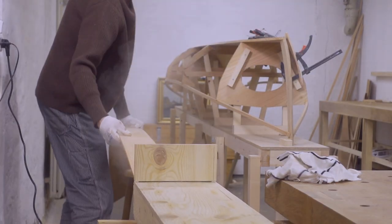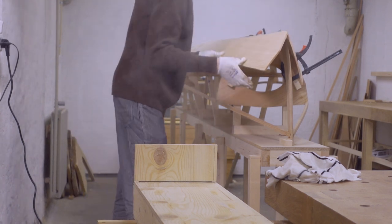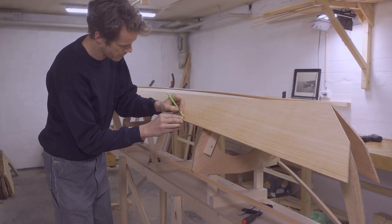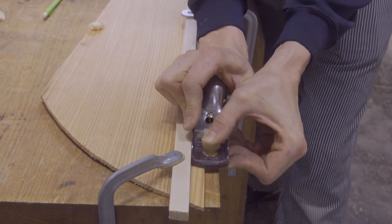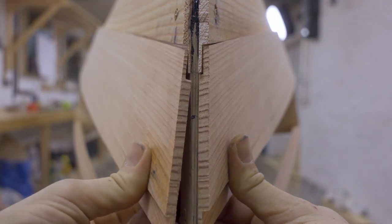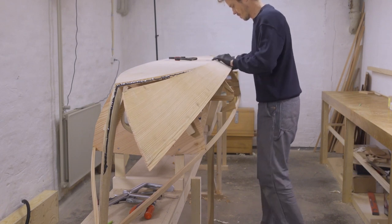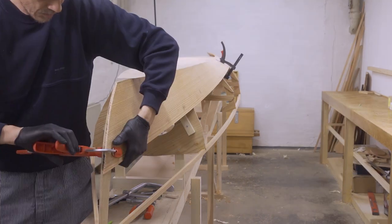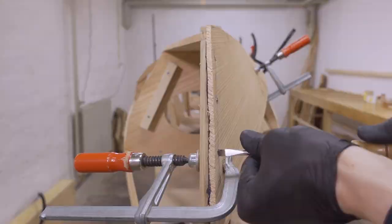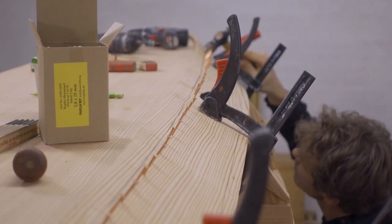Now I'm ready to install the garboard planks on the boat. These planks take quite a bit of a twist towards the ends so I'm steaming them to make them more supple. If you don't have a steam box, wrapping the plank ends in a towel and pouring boiling water over it will most likely work too. Then I'm marking where the garboard and the middle planks will overlap, and at the ends I'm cutting a ramp-shaped rabbet known as a gain. This is necessary to get a watertight fit at the stems. The garboard plank is sealed with a bead of flexible polyurethane caulk. This will strengthen the joint and keep the boat watertight even if the fit isn't 100% perfect, even if the wood swells up in the water and dries out in the sun. With the garboard plank in place I'm fastening it with bronze screws at the stems, bulkheads and frames. The joint between the bottom panel and the plank is screwed from the stem to the watertight bulkhead and copper riveted in the cockpit section of the boat.